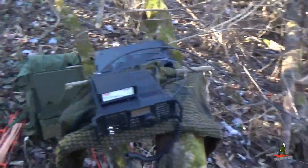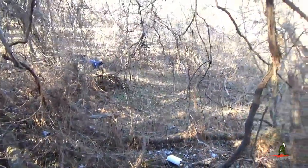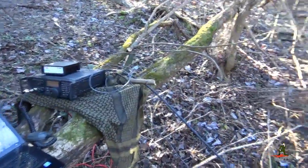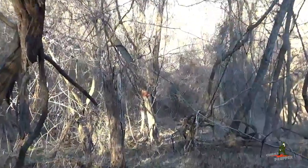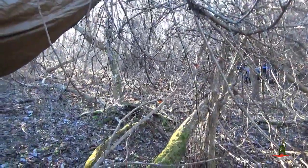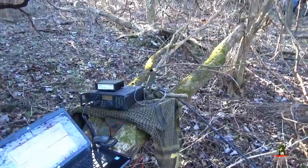I'll pause here, we'll get the antenna wire hooked up, lay out the counterpoise, fire up the radio, and send and receive some HF email from our undisclosed location in the mountains of West Virginia. We have an HF email connection with the station in New York using the ICOM IC7200, with the AH4 automatic wire antenna tuner sitting just below me — a long wire going out to that tree, about 100 feet long. We have a counterpoise running up the hill towards the ATV on Old Orchard Road, giving balance to the tuner. It took about 35 minutes to get it all set up, but we're operational here in the field.